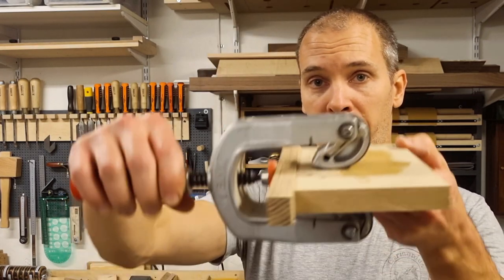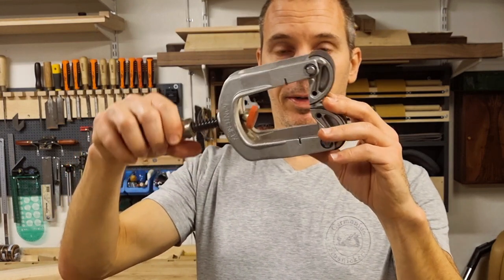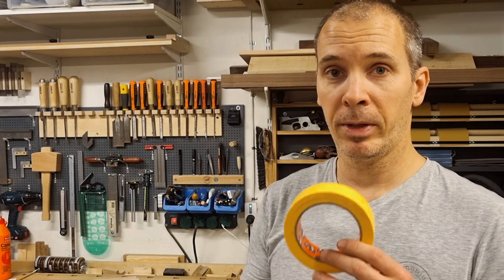While the glue dries, let me mention possible clamping methods. The one I showed — lying the piece flat in regular clamps — is my preferred solution if the workpiece is small enough and my clamps are long enough to reach. For really large workpieces you can use Bessey edge clamps that clamp the edge banding directly to the workpiece, though they are quite expensive and you need quite a few. There are cheaper rubber edge clamps as well, though I haven't tested those myself. Some people rely on tape only — I've used that for smaller projects and it works okay, but you don't get any real pressure between the parts.